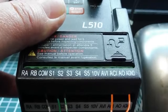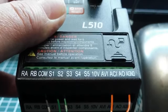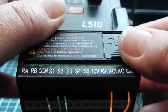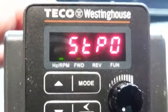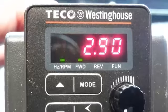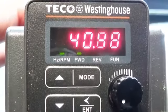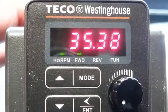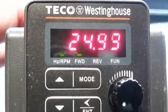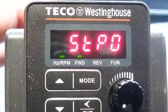And if you look at the very left, you can see switch 1 and switch 2. That's my forward and reverse control that's hooked up to the Nano. So if I give some current into the 20 milliamp current loop into the motor, you can see it being activated. So now the motor is starting to spin. So I got the motor running. I can take it up and I can take it down. So I'm controlling it through the Nano, controlled by my keyboard, all the way back down to stop.